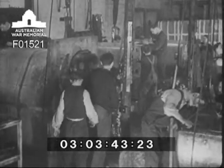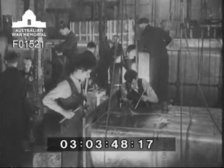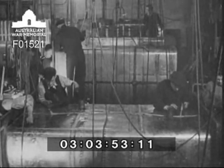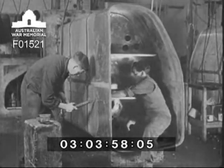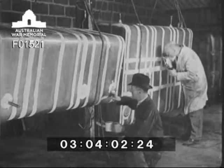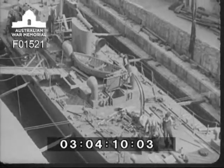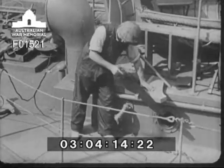These men are working on fuel tanks. This is done at a separate factory, and the tanks are made of copper sheet, riveted and soldered. Inside the tank are a number of baffles to stiffen the fabric and prevent the fuel from surging. Whitewash on the seams enables a leak to be spotted easily, and banging is the final test of strength. Let's go on board now and see how the deck is progressing. Bollards, winches, fairleads, ventilators, and dozens of other fittings are being installed.